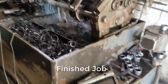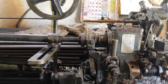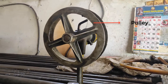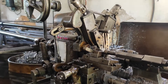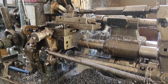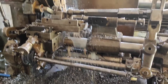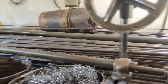The sliding of the tools is operated with the help of cams. This is the spindle, which is continuously rotating. This is the pulley wheel on which the weight is adjusted — you can see both machines have the pulley system. This is the tensioner spring; with the help of this tensioner spring we can slide the tool, and it also helps with auto feed.